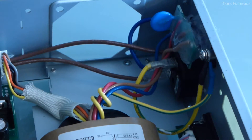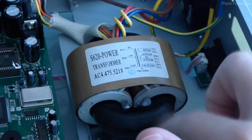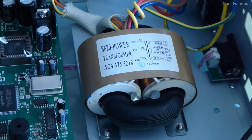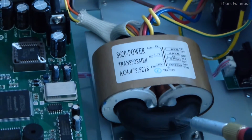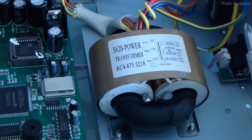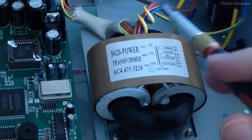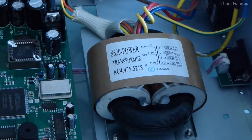We've got a little tiny board down here which has just got a single connector on it for the RS-232, and that connector goes underneath the chassis to the main board. And this is the power transformer — the first thing I've got to say is this is a really sexy looking power transformer. I can't say I've ever seen one that looks like this before. There are two coils with the iron going through it. It's got a little diagram on it. I'm not sure if they chose this transformer for its noise characteristics, but it's definitely not your standard linear transformer.